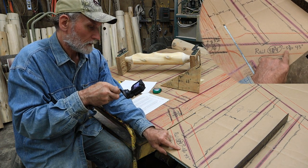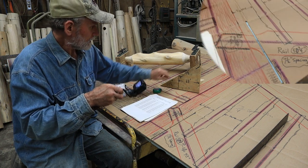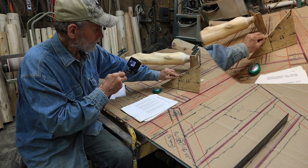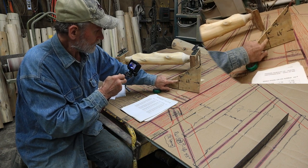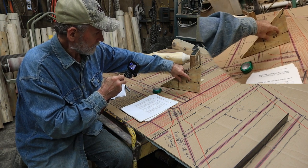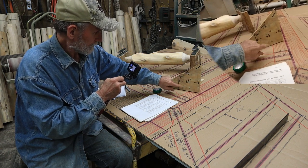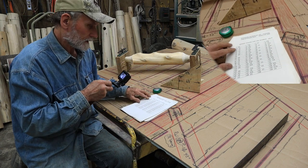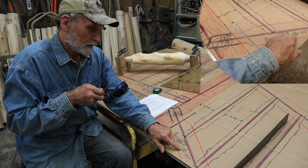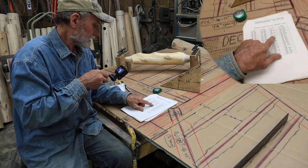And if we take off, to find a number that works, we want to end up with approximately 7.5 inches as far as the travel. That will give us 6 1/4 inches from here to here, because we can go from 6 1/4 all the way up to almost 7. So somewhere between 6 1/4 and 7 to get our spindle spacing working with initially 50 3/4, and then we're going to subtract something off, and we're going to go to this list to find what the something is.